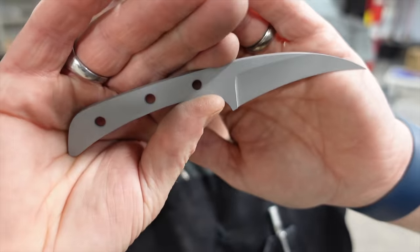So what is gator piss, you ask? Well, it's a premix etchant for knife makers and metal workers by Baker Forge and Tool. Bought this stuff from Maritime Knife Supply. Bought myself one of these OXO containers, which is perfect for it. I think this stuff's formulated to do the best with Damascus, but I thought, you know what? Let's give it a shot with some mono steel.